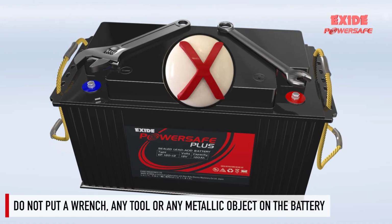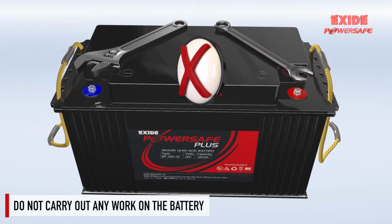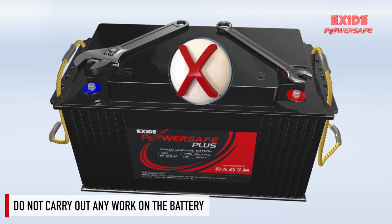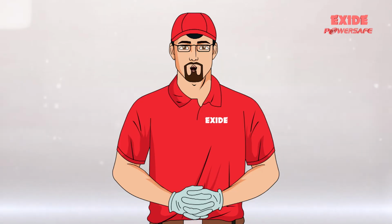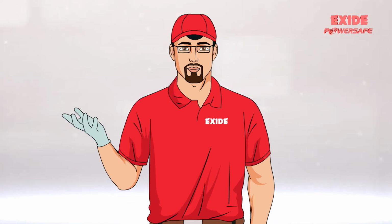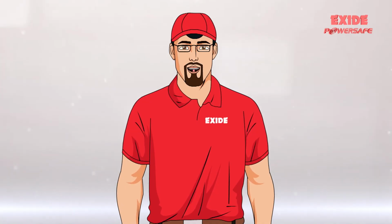Do not put wrench, tool or metallic object on the VRLA battery, nor carry out any work on the VRLA battery. It can cause short circuit and damage the battery. Commissioning of the same is a very important step. The following points will help to ensure that the commissioning has been done correctly.